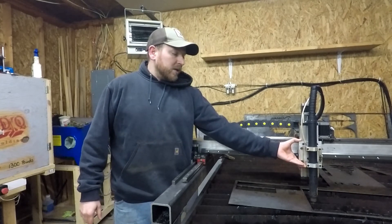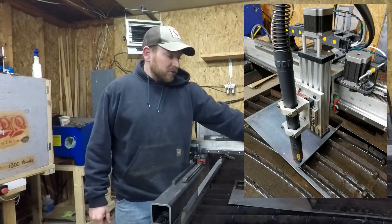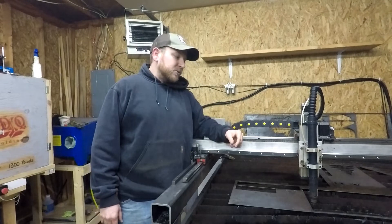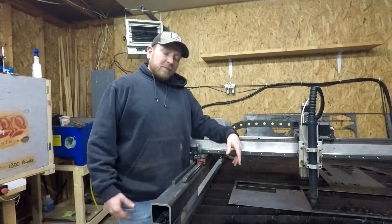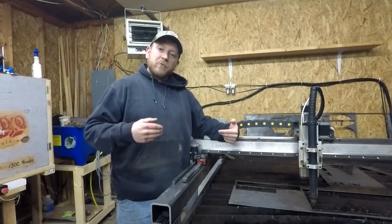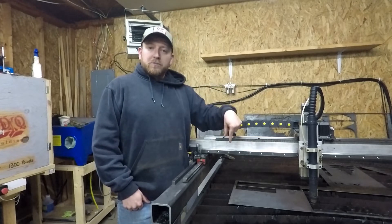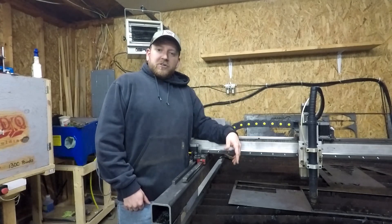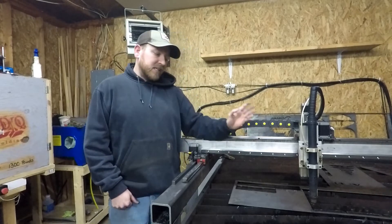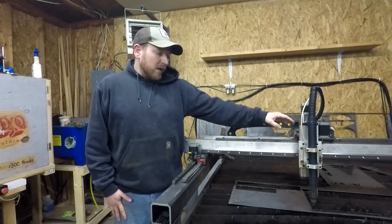I have this floating head that I got off eBay. I had to remove one of the springs because it was too heavy, and there's also some play in it. I used socket-head cap screws but ended up having to remove one because the switch would hit it and become unreliable — removing it made it a lot more reliable. What that tells me is it's probably not repeating in the same place every time: the probe sequence might read 163 one time and 173 the next, which is really not great.